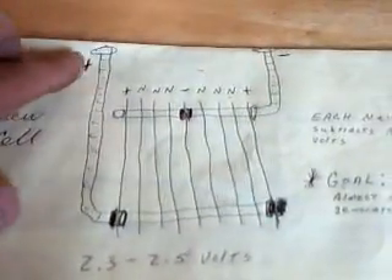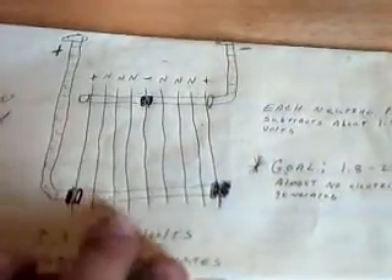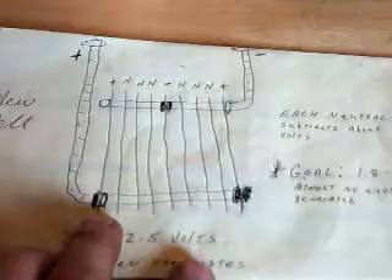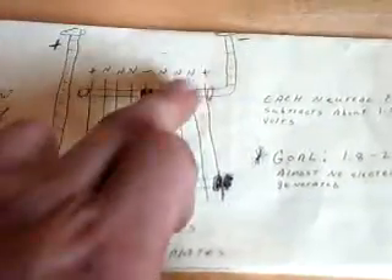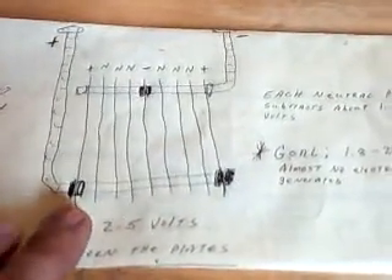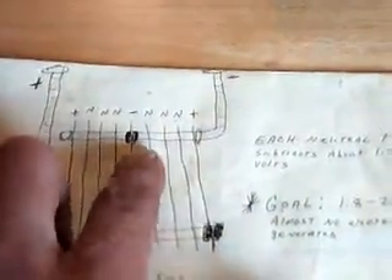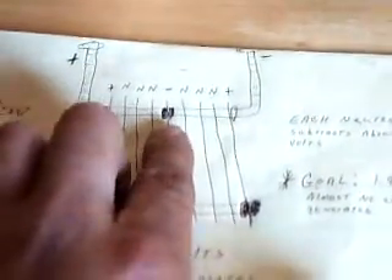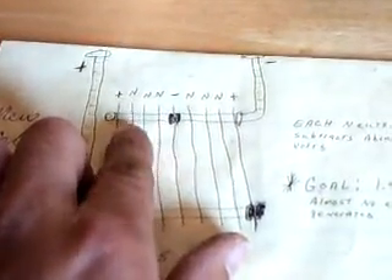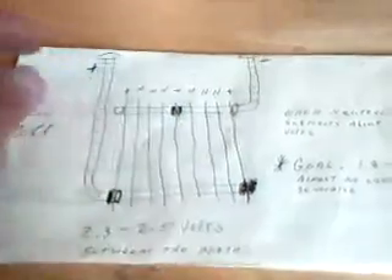What I did here was I took stainless steel bolts and bent them at a 90 degree angle. The holes are all drilled throughout the plates but insulated with some tubing. The areas that I want to connect — say a positive to a positive — on that particular terminal the tubing was stripped away. I put stainless steel nuts here and tightened them tightly on those two plates. Same thing goes for my negative terminal — drill the hole all the way through, with tubing throughout to insulate the other plates so they won't touch, and then connect where you want negative.